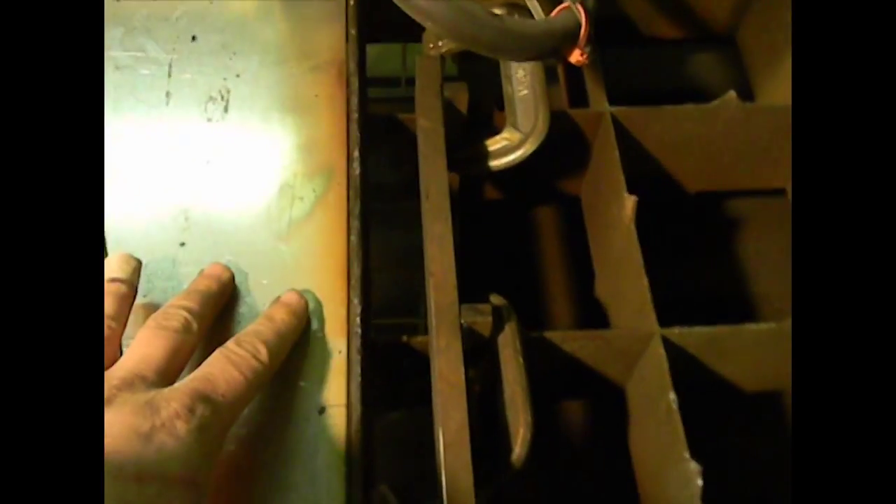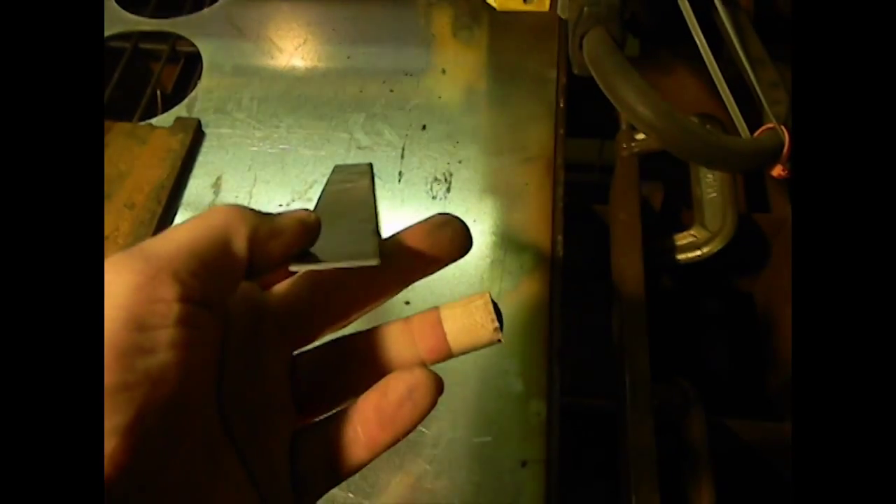The way this is going to work: I bring my material in, it goes against the stop, I drag the plasma torch across using the Y axis of the machine, and I'll get really nice one-inch wide strips of stainless steel. So let's give it a shot.